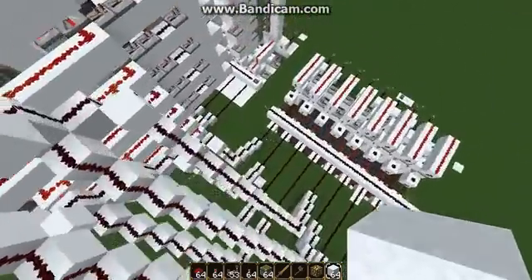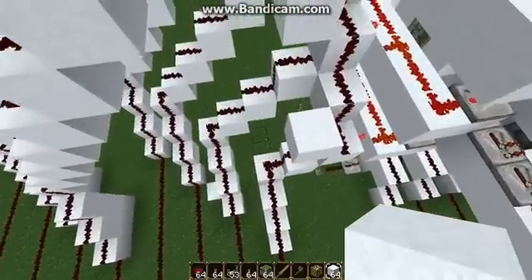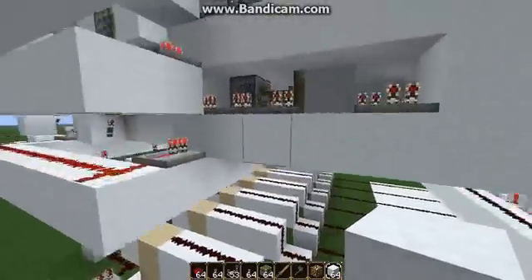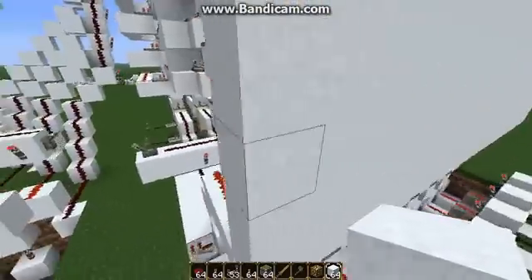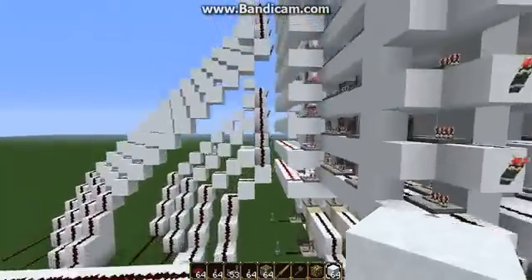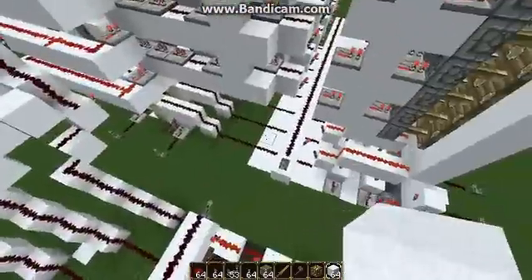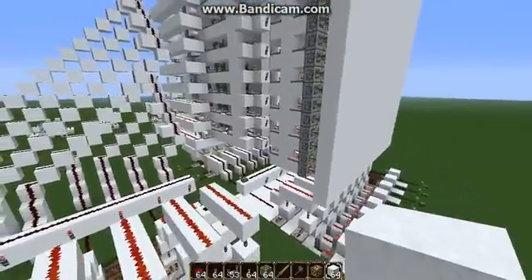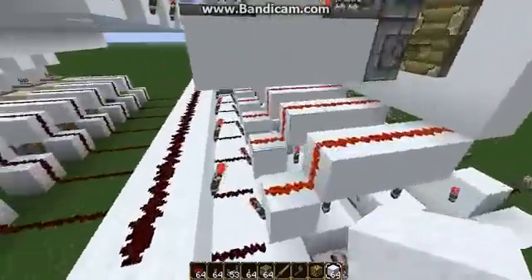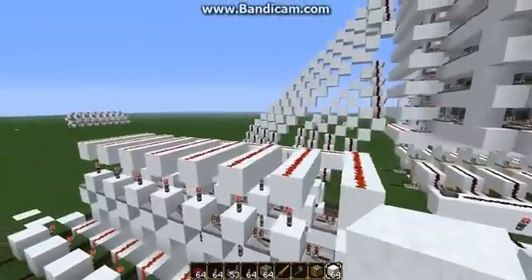Here's what we just did. We took every single Y command — when one Y command is enabled, it's going to enable one entire plane, which conveniently is going to be one of these rows for writing. This is essentially going to act as matching up a Y coordinate to an X coordinate. It's enabling a row for writing, so when the X commands pass through, it's going to be written to that row, effectively selecting a Y location.